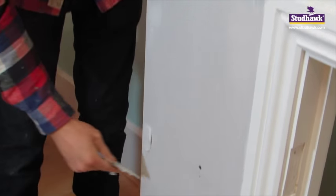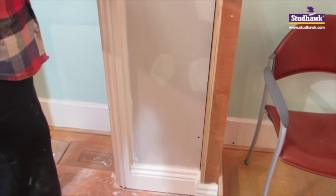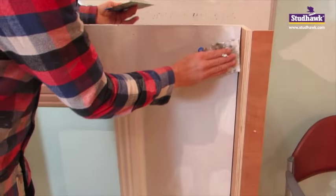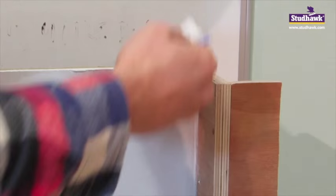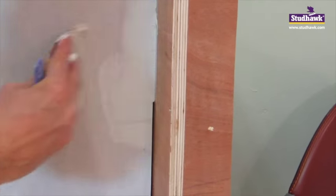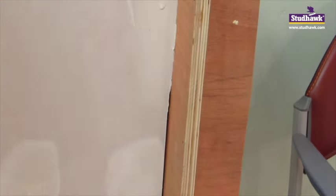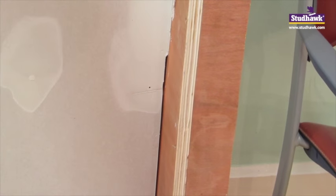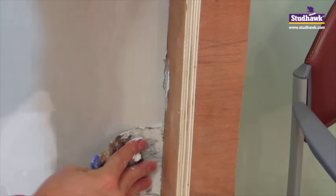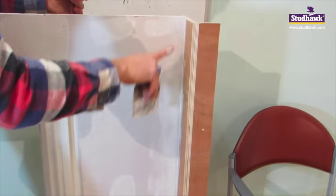All of our screw holes — wipe in one direction, off the other. If this was your under-eaves storage area, or a full-sized partition wall, when you want to do your edges, get a piece like that and push in onto the edge, forcing it into that edge, and then clean up with a finishing stroke. It could be an under-the-stairs WC, the hall, under-eaves storage, or an ensuite bathroom dressing room — whatever. But the principles are the same. Not too much on the knife — you want those nice little ridges to put into your edges. Take both walls like so and you get a beautifully finished corner. It's important to force the filler into the edges so that it's going in to full depth.